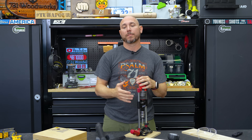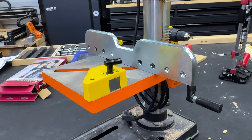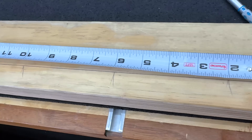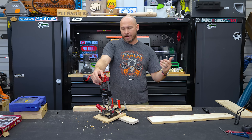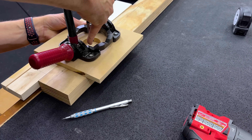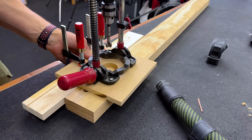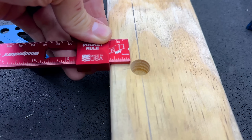If you're just drilling holes on wider boards, you're not going to have any problems. On a drill press, you have a fence and you adjust it wherever you need it — well, you can do the same thing here, but inverted. To add a fence is very easy. I needed to mark exactly where I wanted my holes — a set of holes one inch from the edge of the board, then every two inches down the board. Once I have those lines laid out, I just set the drill guide on top, get close to the center, and hold a scrap piece of fence underneath. Wiggle it around until you find center, then use squeeze clamps to hold it until you put a couple of small F-clamps on there. And then you have repeatable accuracy from the edge of the board. I checked it with my Woodpecker square — perfect.